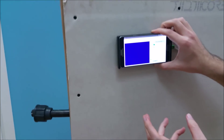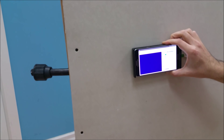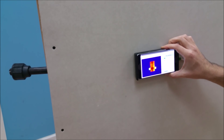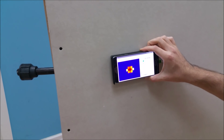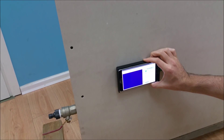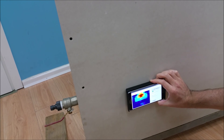Wallabot's now detecting — nothing's being shown because there's nothing behind the drywall. As I move it around, we start to see the plastic pipe is being detected and it updates as I move. Nothing behind here. And you can see a stronger detection for the metal pipe.